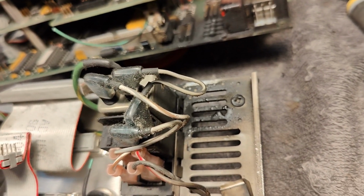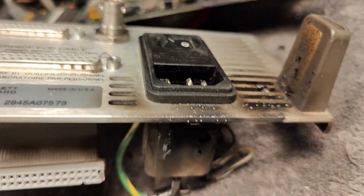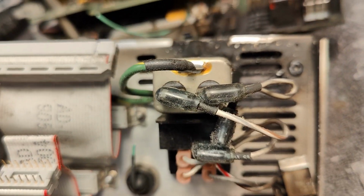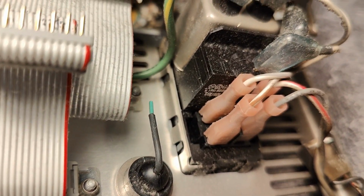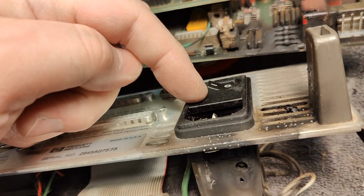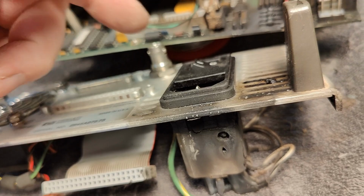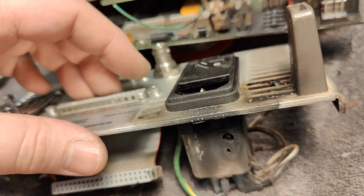And why didn't the fuse blow? Well, that's because if you see mains entry, it goes to that filter unfused, and then on the output side of that filter, it goes to the fuse. That is the black thing here on top, and then you have a mains switch. So that will be the fuse, and it's located after the filter. So that explains a little bit all this, the energy that can happen, right?